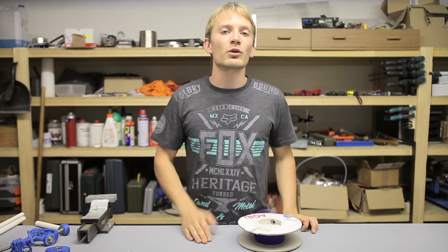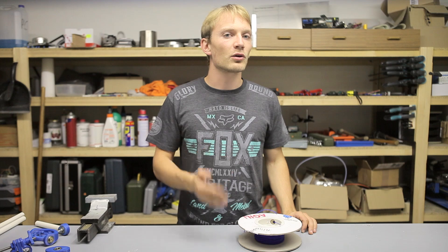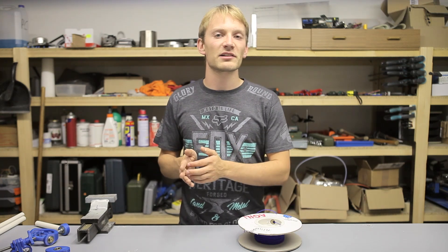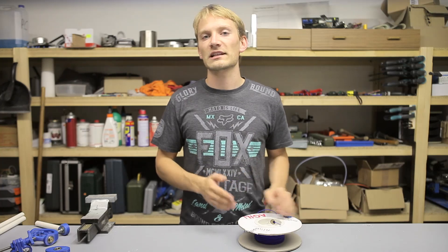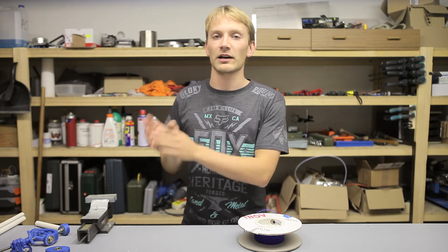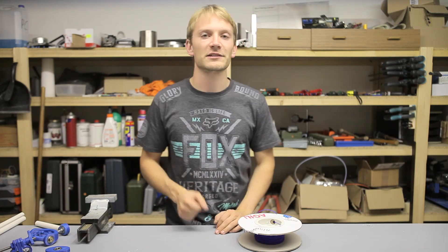So that's the most important things to keep in mind when you're trying flexible filament. As far as the other settings go, it's all cooking by the book. Extruder temperature around 215 degrees Celsius, and bridges and overhangs might be a bit harder to print. So there you have it — thanks for watching, make sure you like, subscribe and share this or any of my other videos, and check out the survey in the video's description to influence which topics I cover next.